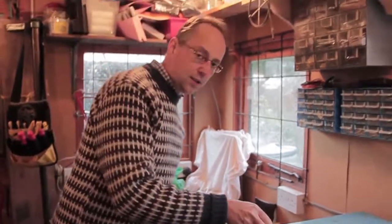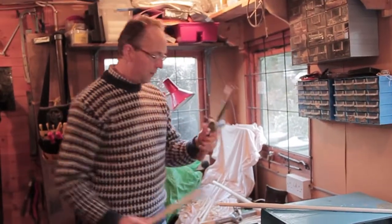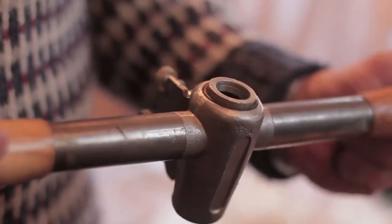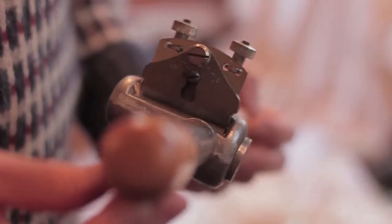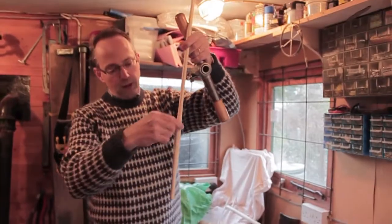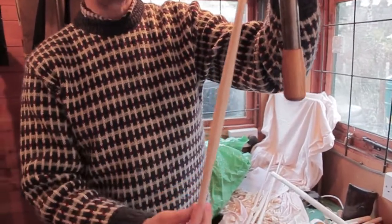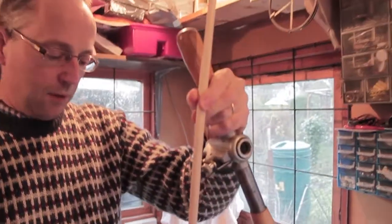I'm using the Fred Lambert rotary planes. At the moment I'm just taking the timber down and getting it roughly smooth with this one — they come in different sizes. I'll now go in and use one at half an inch. I'm putting a slight bulb on the spindles because I think it's quite attractive — half an inch, three-eighths of an inch at the top with a bulb section there.